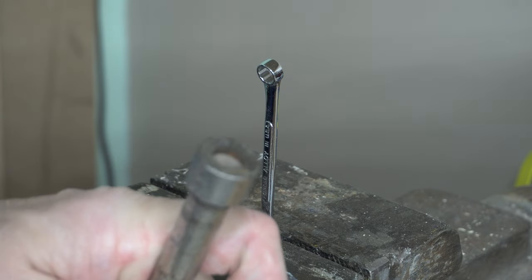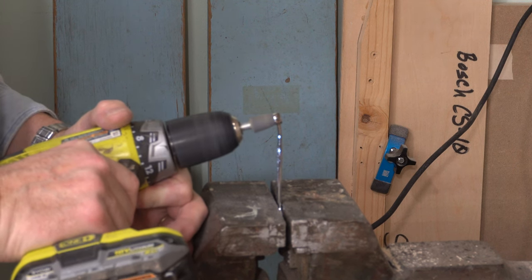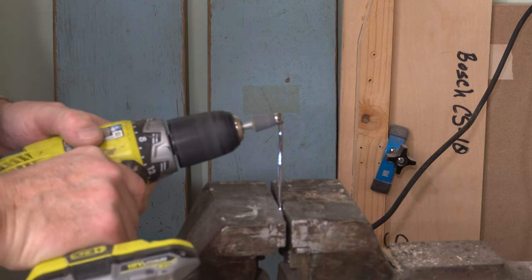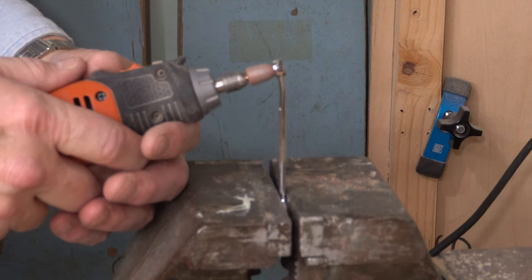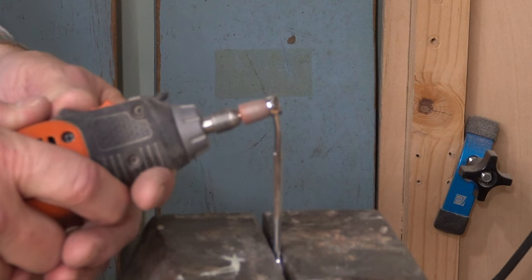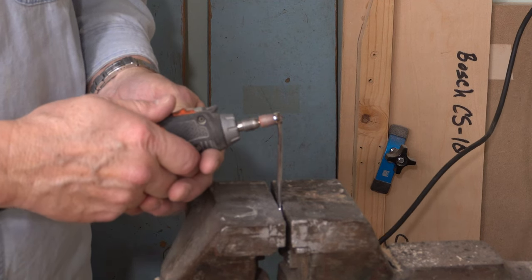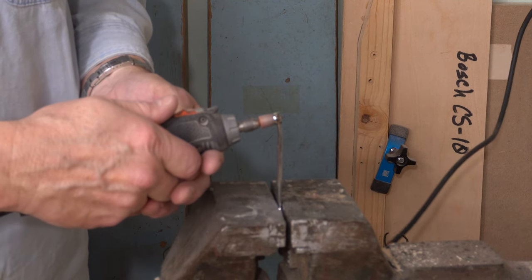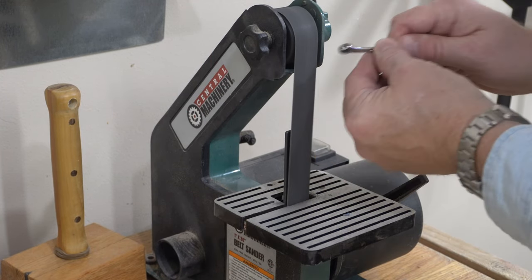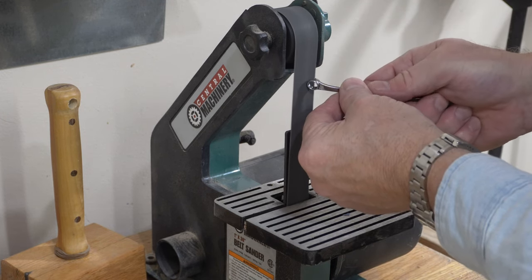Time to make the cutting part of this new tool. I took the leftover small box wrench and locked it into the bench vise, starting with a coarse cone shaped grinding bit. I started to remove the inner flat edges of the wrench, thinning the steel down on the inside of the circle. I then moved over to a much finer grit cone grinder using my mini rotary tool and started to get a sharp inner edge. I also flipped the wrench around to carve out the backside and then started to thin down and sharpen the outer edges with 1000 grit paper on my mini vertical sanding tool.